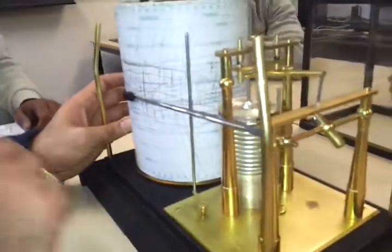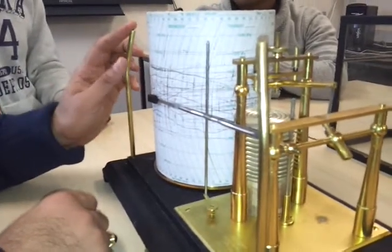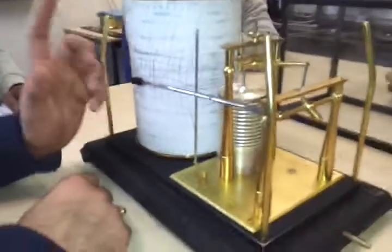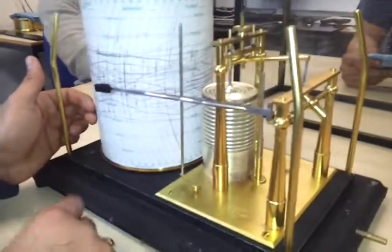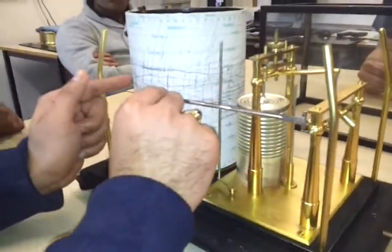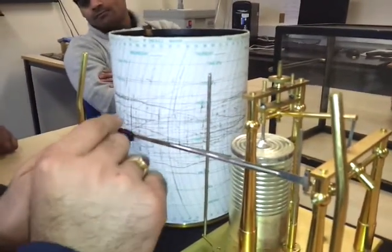Another favorite question of Captain Anam is about barometric tendency. What this instrument is doing for us is recording pressure variations — we are getting the fluctuations of pressure. We are not getting precise readings from this. The silicon oil has one more purpose: to reduce vibration so that when your fiber nib is printing the atmospheric pressures, it draws fine lines rather than thick lines.